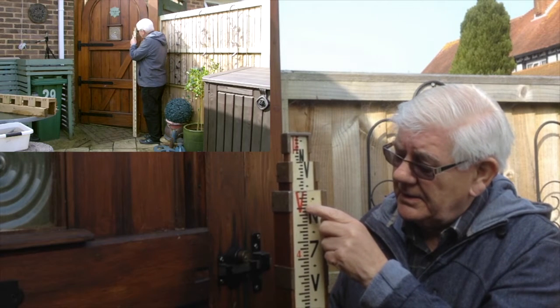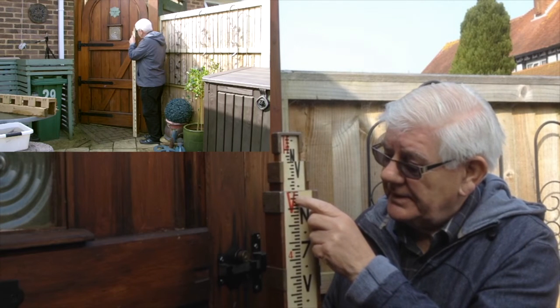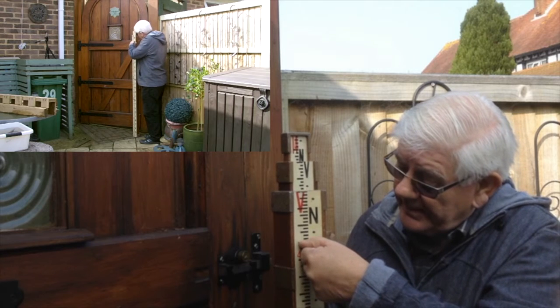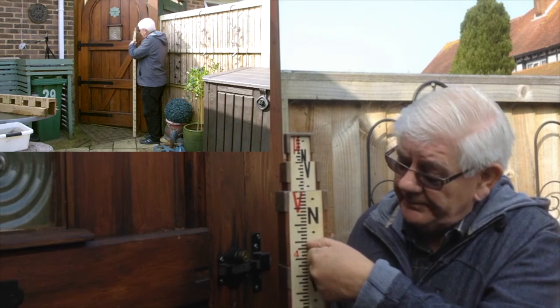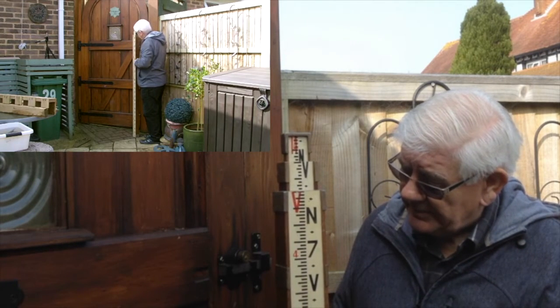The width of the white is exactly the same as the black, so readings go zero, zero one, zero two, zero three, zero four, zero five. It's always the top that you read on the staff, on the level line inside the instrument.